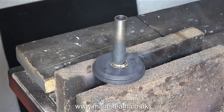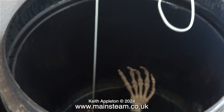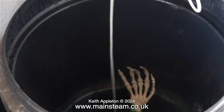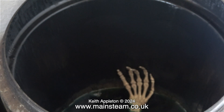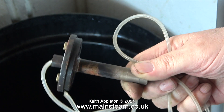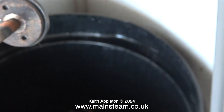As with the boiler barrel, do not quench this part in water. Leave it to cool to black, then leave the part on the firebricks to cool for a while longer, and after that you can place them in the acid bath. In goes the boiler barrel. The acid I use is really just kettle descaler called Kilrock K, and it's not even strong enough to dissolve these bones. I do need to top it up a bit because it's quite weak — I've used it a lot for this purpose over the years. To clarify: for cleaning silver-soldered components, not dissolving bones.